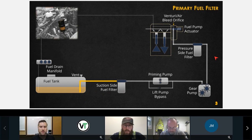So the heater is a very simple electrical component. Typically, yes. Power and ground. So I can unplug it, stick a sealed beam light in there. If my sealed beam light is nice and bright, then that verifies circuit integrity also. Yep, or just a resistance check on that heater itself. Yes, but a resistance check isn't checking the circuit loaded. When I'm checking electrical, I always like to make sure that I'm checking it loaded. That's just my preference. It's just a heater circuit though, right? Yeah, it's just a coil of wire, a big resistor.